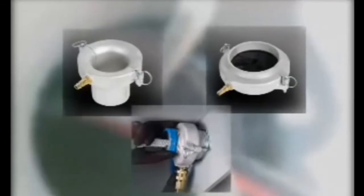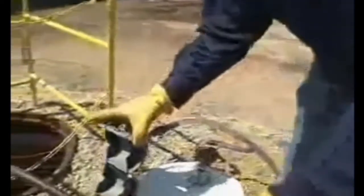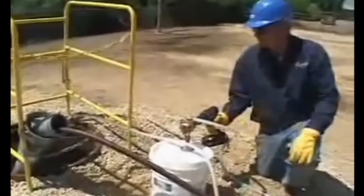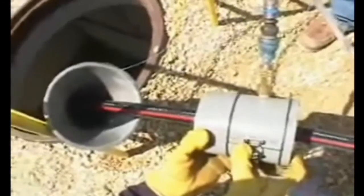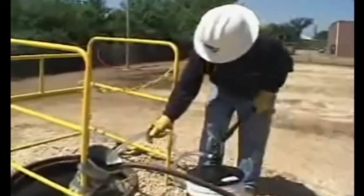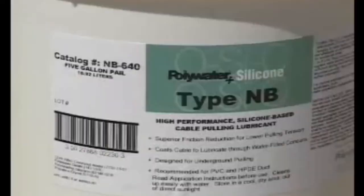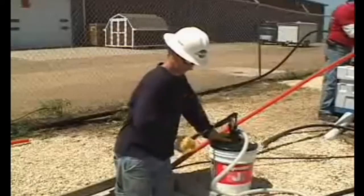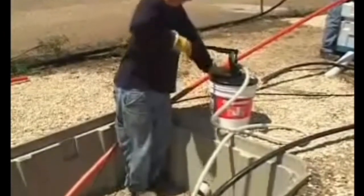There are several different types of lubricant applicators you can use to apply Polywater lubes to cables. Open the split device by releasing the hasp in the middle of the applicator. Place the device around the cable or wires and refasten. As lubricant is pumped into this applicator, the internal applicator flaps coat the cables as they pass through. Control the pumping rate to completely coat the cables but not overfill the sleeve. Lubricant applicators can be used in horizontal or vertical applications. Gel lubricants are recommended to prevent lubricant dripping. In summary, choose the pump, applicator, and lubricant that works best for your job. Use the Polywater calculators, then use the pumps and collars to thoroughly coat the cable jacket with lubricant. This will optimize lubrication and minimize cable pulling tension for an easier, quality cable installation.